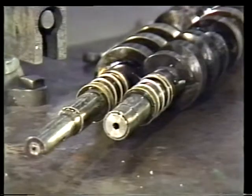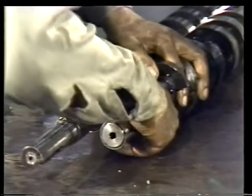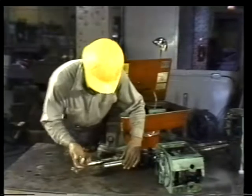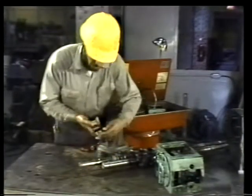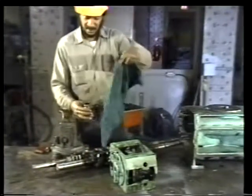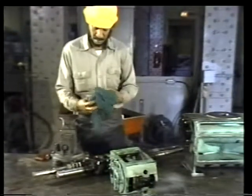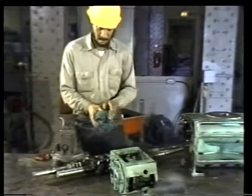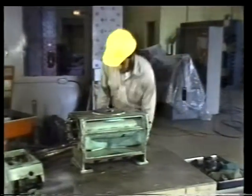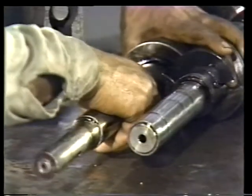The mechanical seals on the inboard end of each rotor should be removed the same way as the outboard seals were. First, pull off the carbon sealing face, the cartridge, and the spring, and then the backing plate. Protect these parts by wrapping them carefully in a clean rag, and set them in a pan. Repeat this procedure for the last mechanical seal.